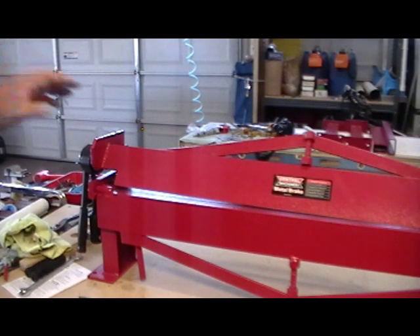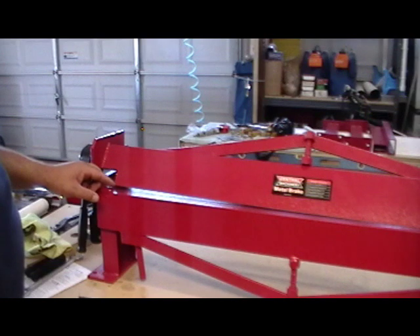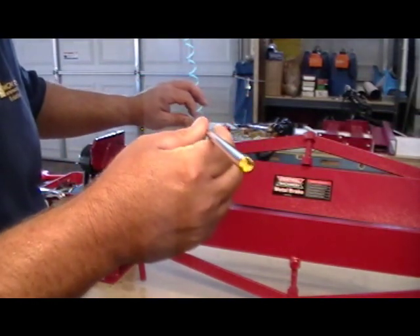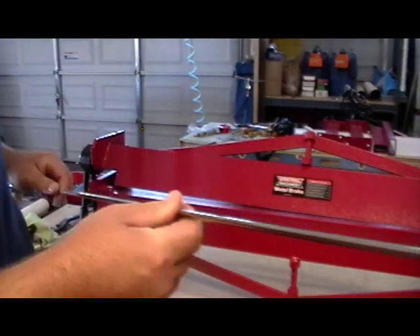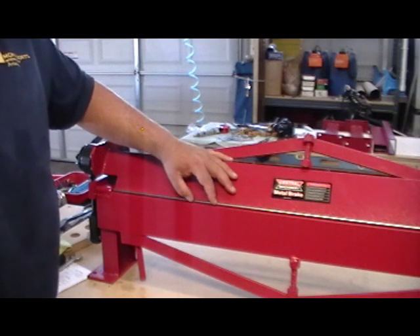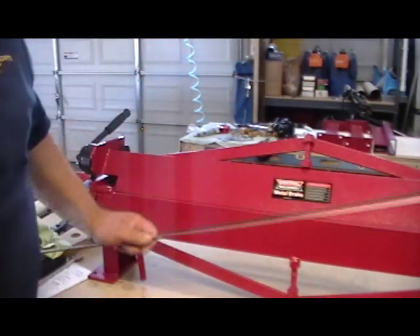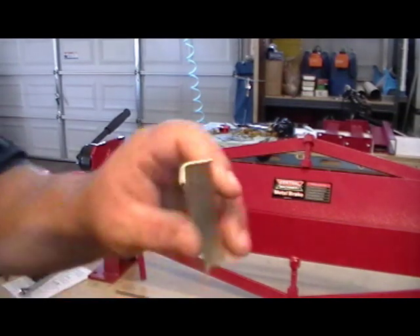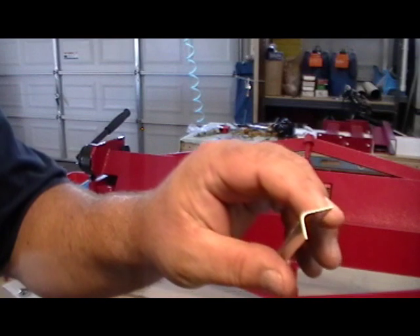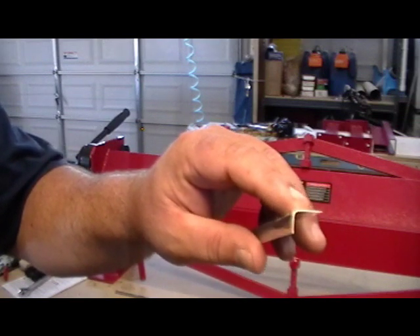What I'm going to do is remove this shoe, put it in a mill, and mill off about a quarter inch of the face. Then we're going to weld in this quarter-inch piece of drill rod — nice and round — right along that edge. So now when we bend our metal it's going to bend around that radius. We'll have a nice bend radius on our piece, and it's actually going to be a little bit bigger than the example here, which is even better. A quarter-inch rod gives a minimum one-eighth-inch bend radius, which is the minimum for 0.032 material. The smaller stuff will just get a bigger bend radius — it won't hurt it, it'll just make it even less likely to crack or break.